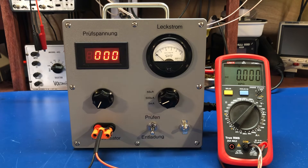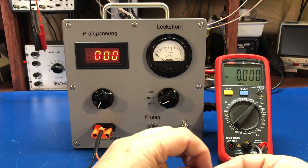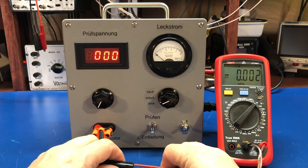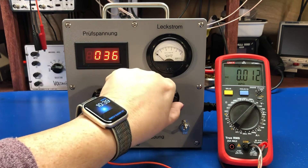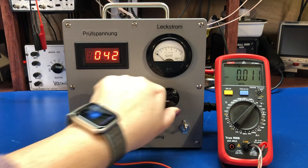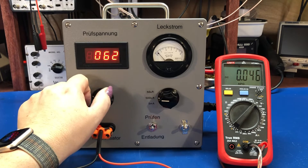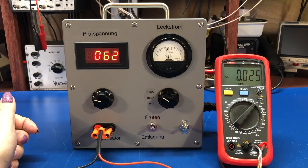You don't have to test just high voltage caps. This is a 10 microfarad, 63 volt cap. We'll just test this one last. If we look, it's got the same behavior. As we can see, this is coming down — it's at 20 microamps. If we let this go for a while, it would probably come down lower.